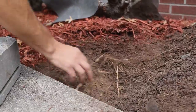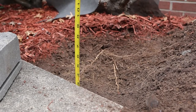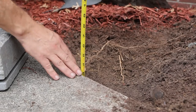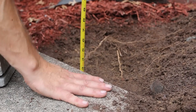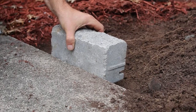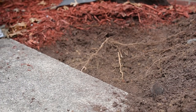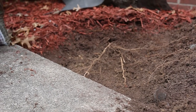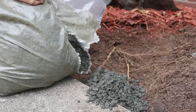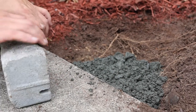We want to excavate down three inches so we can get plenty of aggregate base underneath the paving stones. No matter if this is concrete along a walkway or grass, you're going to want to excavate three inches down behind the surface you're trying to highlight. So we've got three inches excavated. Now we can come in with our paved stone paver base — basically just crush and run — and put in a nice layer. This is going to act as our foundation so the paving stones aren't going to keep sinking down into the dirt.